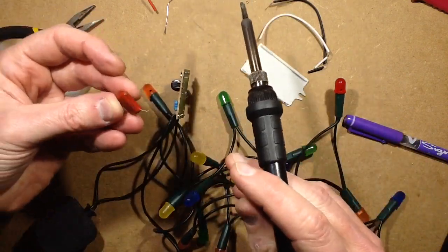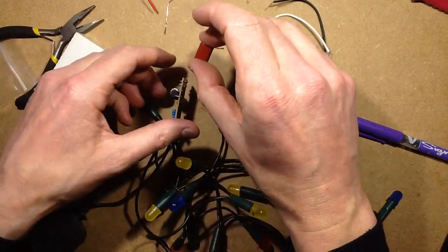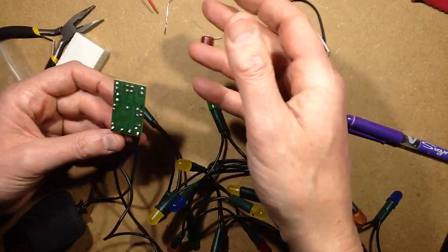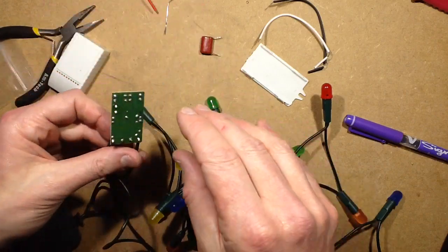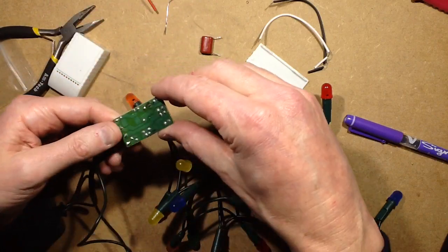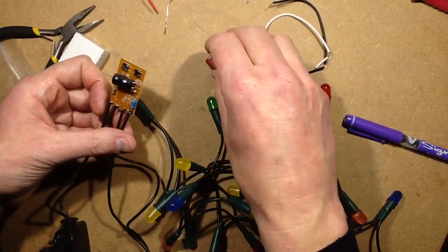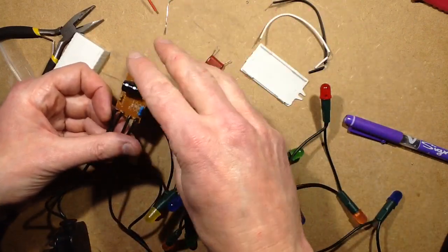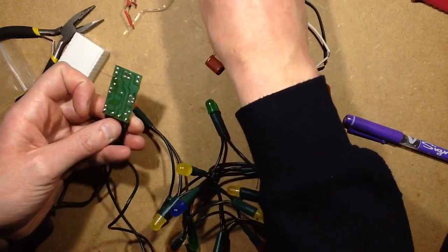In relation to what I was describing about how this works, the value of the capacitor in nanofarads or microfarads or whatever, relates to the area of the plates, and ultimately the amount of charge they can hold. So in this case, by using a smaller capacitor, less charge gets transferred in each half of the sine wave.